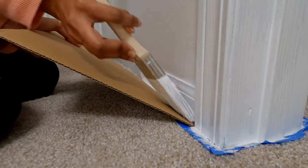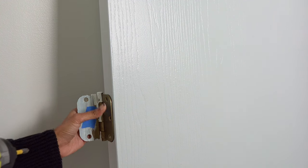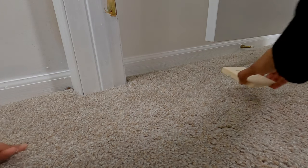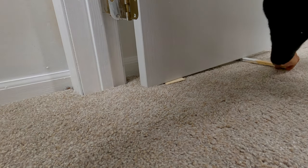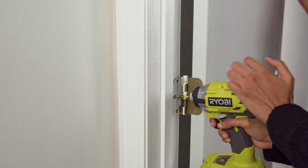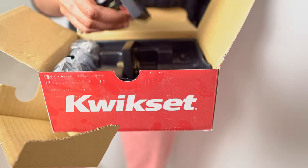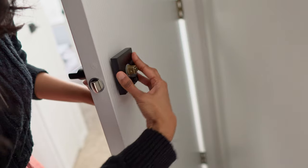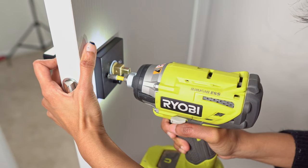Next, let's mount the doors. First add the hinges on the door side, then place a riser on the door bottom to align the door hinge to the frame hinge. Screw the center hinge first, then proceed to the top and bottom. Next, attach the door handles back. Here I use the same hinges but I'm updating the door handles with Kwikset privacy lever handles — the black color is going to look amazing on these doors.